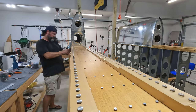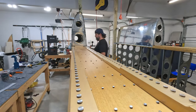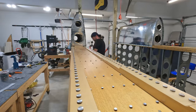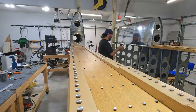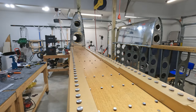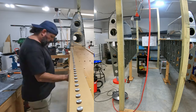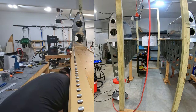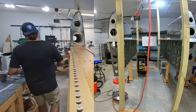The inboard and outboard ribs on both wings are done with driven rivets. The interior four ribs will all be done with LP4 blind rivets next week after the tool arrives, so I can set them - or rather pull - at an angle without angling the inside of the rivet. It's something we had to do when we were riveting the Z-brackets to the rear baffle of the fuel tanks, where those rivet heads sit too close to the vertical portion of the bracket. You need to be able to get the collet of the rivet puller at an angle without causing the rivet itself to bend.